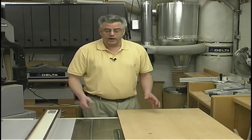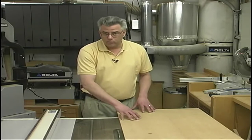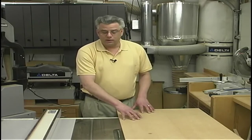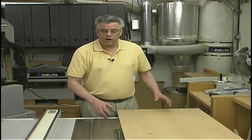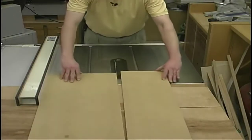For the top, you could use three-quarter-inch hardwood plywood, and that would be perfectly fine. However, I wanted to use the veneer that's going to match my front panel, so I'm going to be laying up my own plywood. I'm going to start out with half-inch thick MDF. I couldn't find one-inch thick MDF, so I'm going to laminate together two pieces of half-inch thick MDF. I'll cut up that core material now — at this stage I am going to cut it oversized and then trim it up and square it up later.